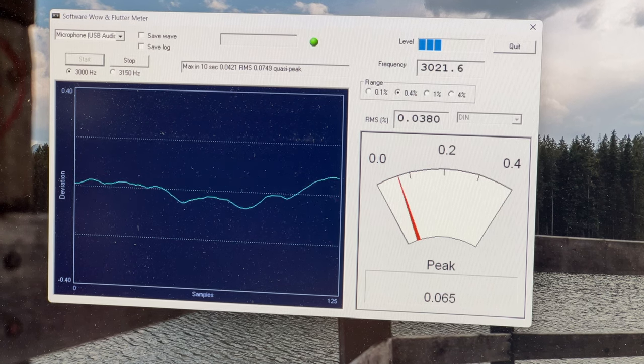Right up here in the decode calibration for the Dolby C playback, they've got VRA01 and VRB02. Those are the wrong adjustments. VRA01 is correct, but this one should be VRA02. So yeah, watch for that. But again, as you can see, I've made conversions over to volts for all of these.